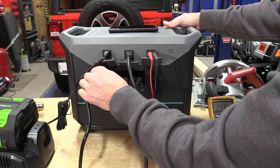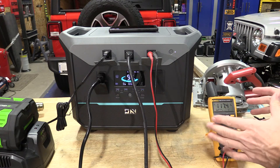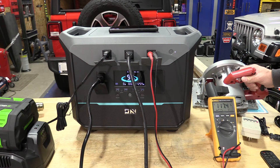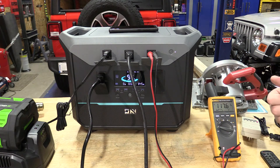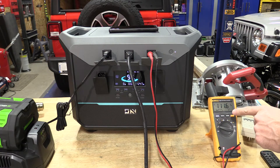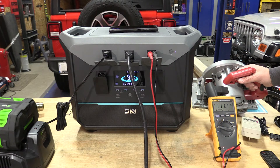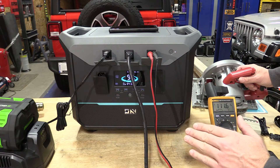With the DC off we're at 111.7 volts. Plugging back into UPS state so it's going to charge, we go up to 122 volts — that's what I'd like to see. We're at 117 because we were obviously charging. Let's take a listen to this circular saw starting up. It starts right up, rock and roll, ready to go. Now unplugged, we drop to 111 volts. If this is rated 15 amps and going to deliver that quickly, we'll hope the saw starts the same.